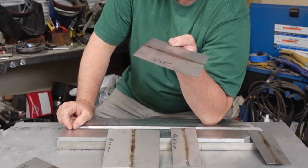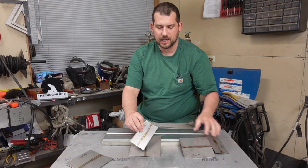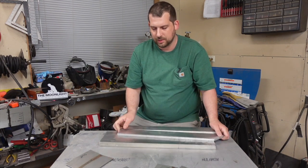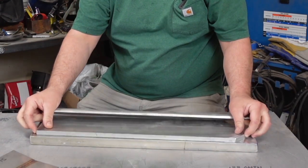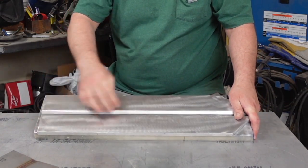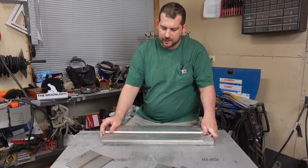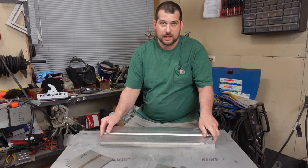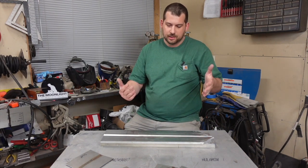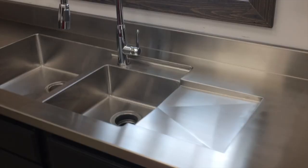The aluminum ones did really pretty well, but if I would have had another heat sink over the top it would have done even better. One setup you could have is a piece underneath and then two pieces on either side of your joint, and in this case I even got them beveled a little bit so you can get the tungsten in there and get them as close to the weld as possible. You can also cut these in different shapes to fit different contours. Anyway guys, hopefully that helps somebody out there — we'll see you on the next video!